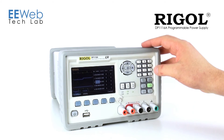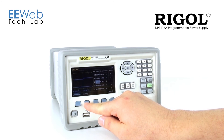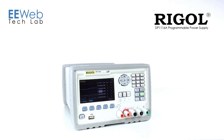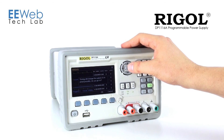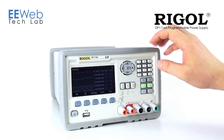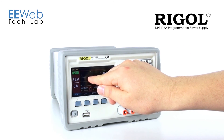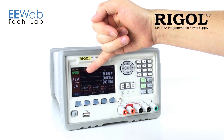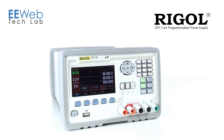So if I want to loop on that three times, I push 3 and hit OK. If I just wanted to loop infinitely, I select infinity. To start this timer function, I simply press the timer button again. It's going to warn me that it might change my output depending on what my output is now. I press OK, and you'll see that it begins the countdown on the first setting. And now it's moved on to the second setting. You can also see this in the wave display — where it went from 0 volts up to 5 volts, then to 10 volts, back down to 5, back to 10. It will keep doing that.